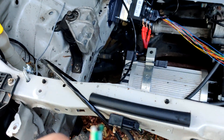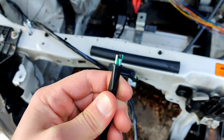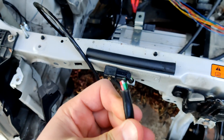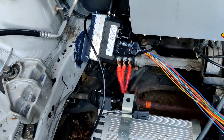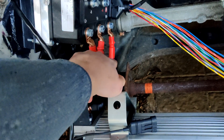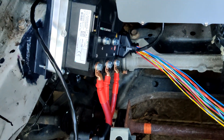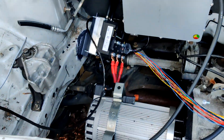Inside this sheath there are three different color foils: blue foil, red foil, and green foil. The foil is for electromagnetic interference shielding, because these three AC phases produce quite a bit of electrical noise, and you don't want that interfering with all the signals to the encoder and to the thermistor.